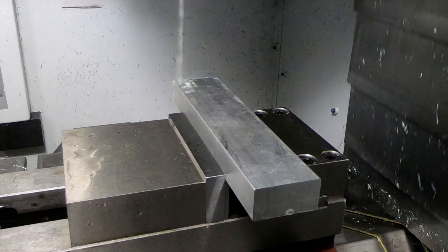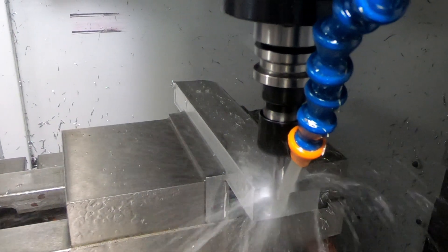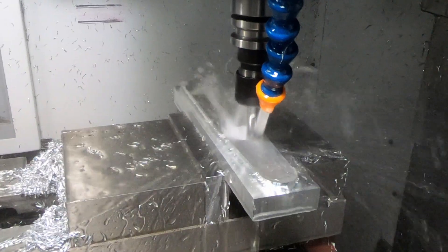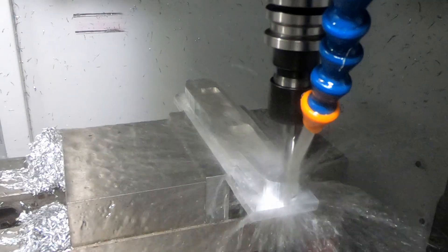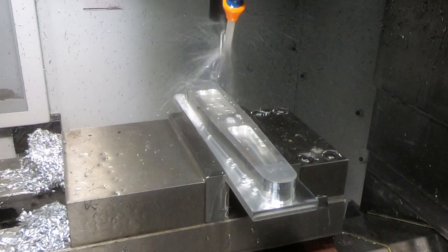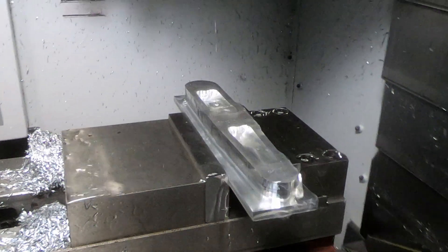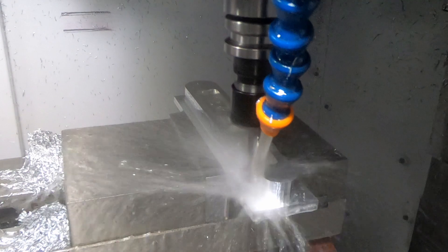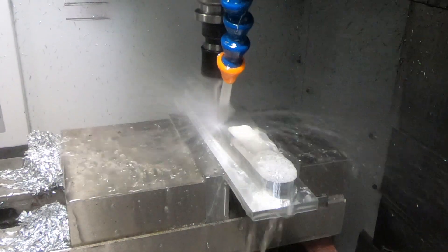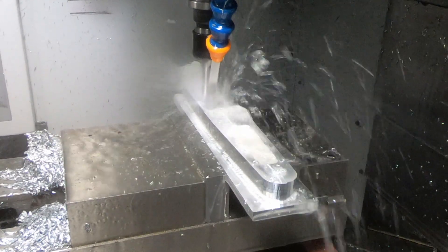You'll see that right here, it starts out fairly quick and then slows down. That's because I set the rapids to 5%, which is something that I like to do on a first job to make sure I don't crash. This time I also switched to thicker material — I'm using three-quarters of an inch thick material to make a half-inch thick wrench. I did this because I ran out of half-inch material, but also the nice part is I don't have to use a fixture like I did last time. I can mill it from one side, flip it over, hold it in the vise regularly, and then mill it from the other side. I left 20 thousandths to remove from the top so that I'd mill both the top and bottom sides, giving a uniform look to both sides.